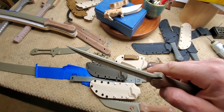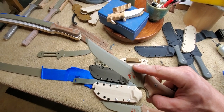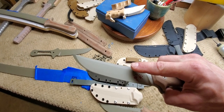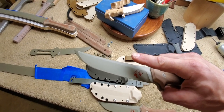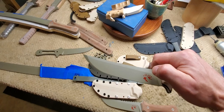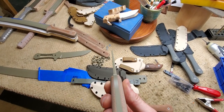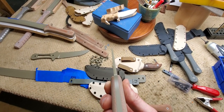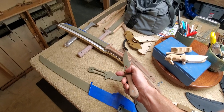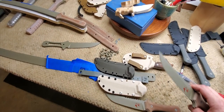I don't know what that's called in Japanese, but these have a distal taper. I ground them with a grind line that went higher than the spine, and then I came back with a file and draw-filed them down, so I got a concentric offset line. You can see in the photograph that it gets more slender as it goes away. I did that on this Tanto and on the wakizashis, but the 3V katanas I did not — I didn't even know I needed to do that.